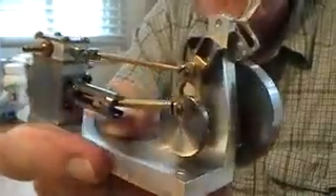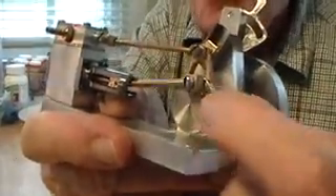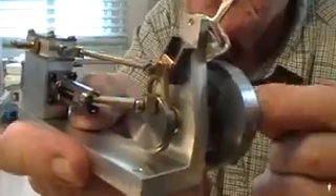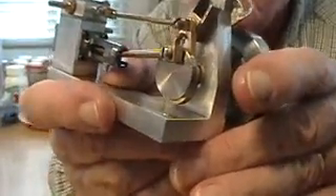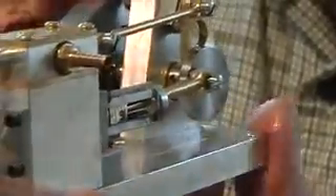It's a nice little engine when you finish, but I had to make several parts over again. They say to machine the crank and shaft out of one solid piece — nonsense! I did it as a separate bit and pressed in the shaft. It's a nice little engine but a bit of a problem to put together the way they wanted it. Like everybody else, I thought I can do better — so I did it better, and there it is.